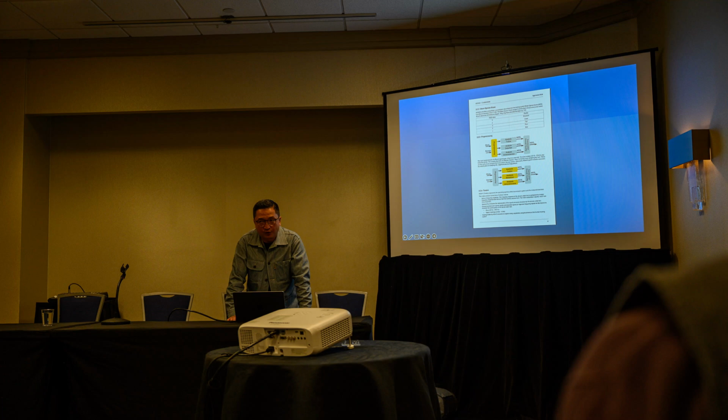So, head acoustics. For those of you who don't know, the 4.4 is actually validation of Brüel & Kjær's work, because it is essentially a subset of 4.3. Now, they do make reference to a reference plane, because in that case there is one. It's essentially a modified 711 with more back volume to make up for that additional volume. Yes, we tested with it, so if you want to see some measurements, I can pull a couple up.